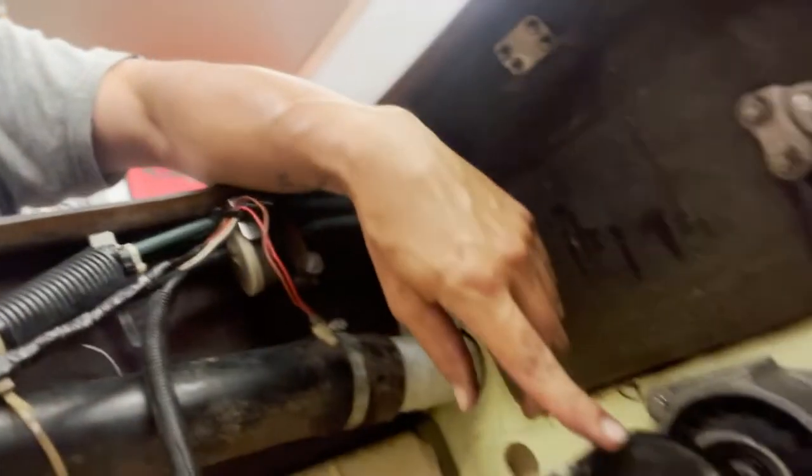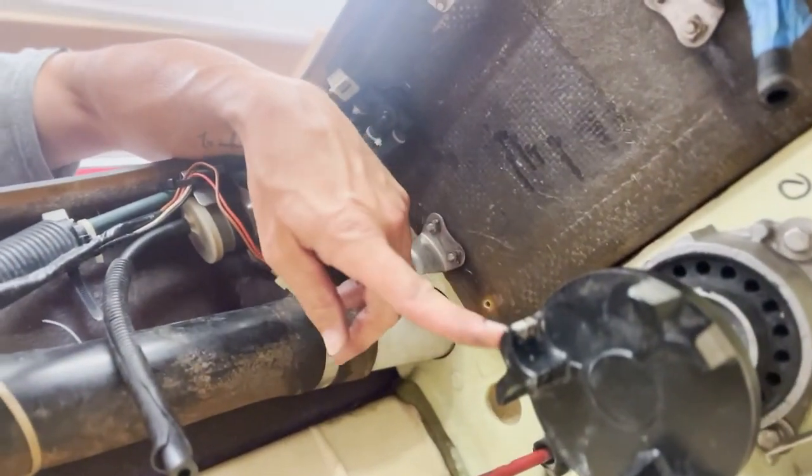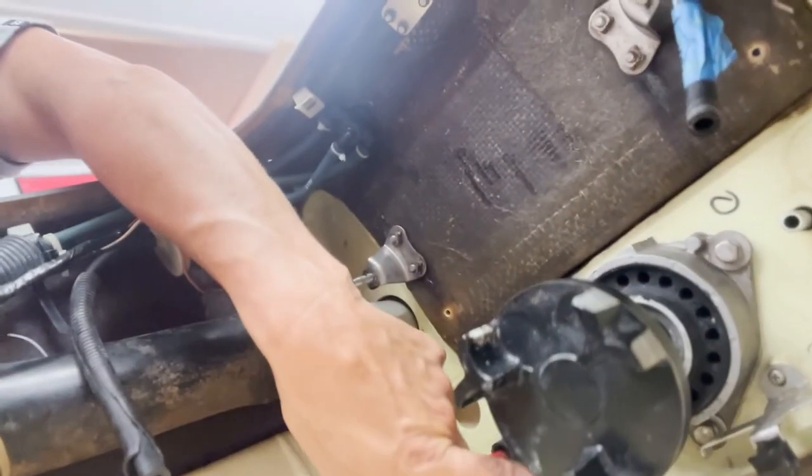When you put your motor back in, make sure you shim it correctly so it is level at the couplers. I typically use a credit or debit card — just hold it on the edge and that's how you know how to shim your motor. Check at least three spots: lay your credit card across the coupler, then again, then again. Make sure everything is straight across, and that the gap is equal all the way around. It's not difficult, just a bit of a pain to remove everything — but Yamaha made it easy.